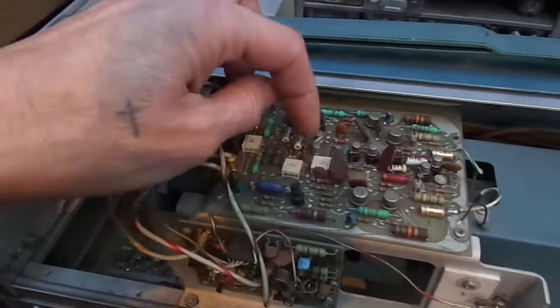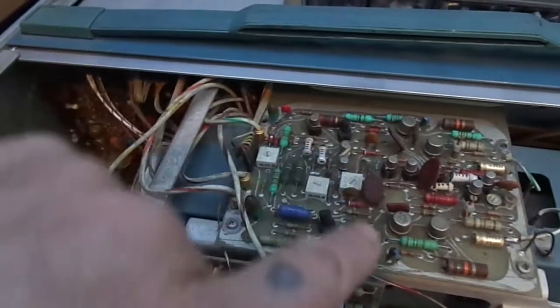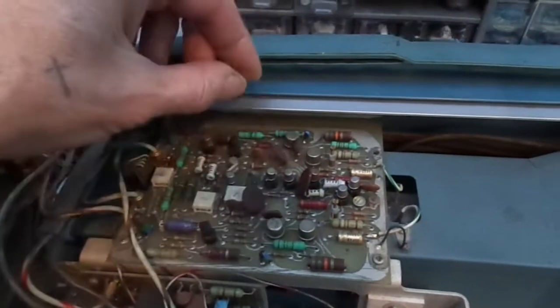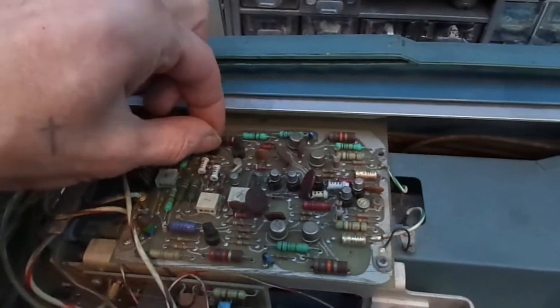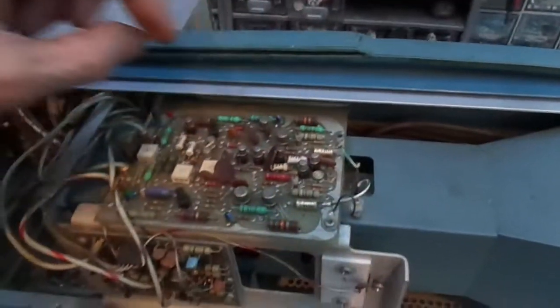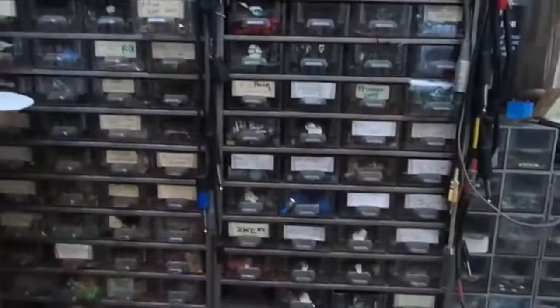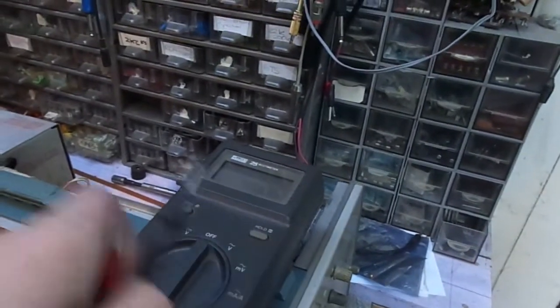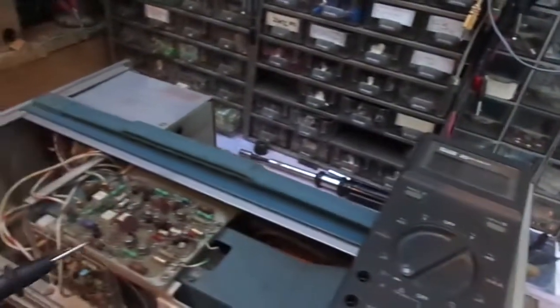There's another little one down there which looks a bit black, but I need to get a magnifying glass on that. I've got the usual daft transistor connectors or sockets. I've checked them out already, just with a meter on the continuity buzzer.